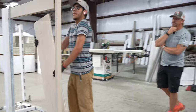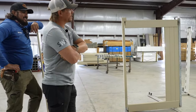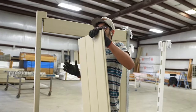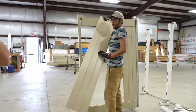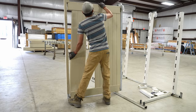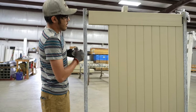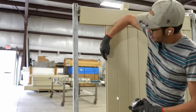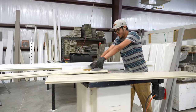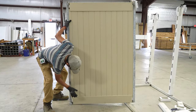Victor's nephew Julio is going to show us how to install the panels — or pickets, as we call them — correctly. With the slash at the bottom, you get the corner in there, it goes in easy, and then the top slides in easy as well. The panels themselves are about 11 and a half inches wide, so we have to cut them down to fit. Measuring from the edge all the way to the end we get nine and three-eighths inches, then pop it in.